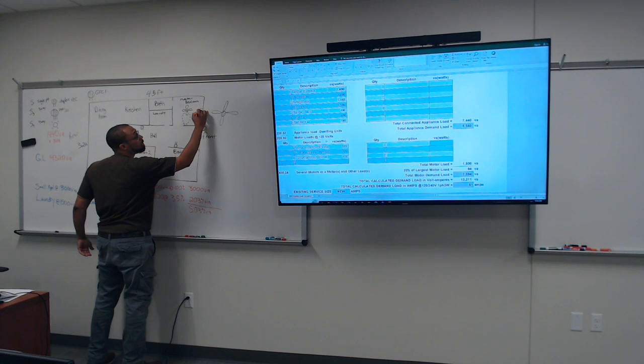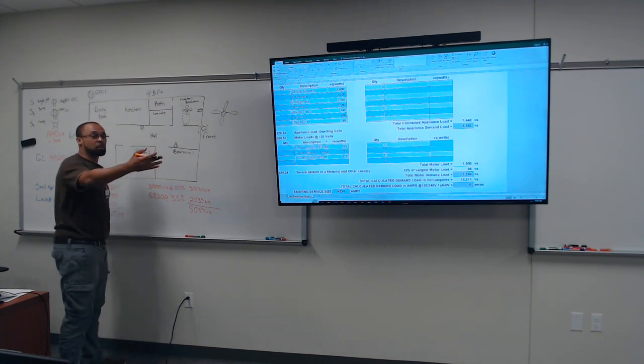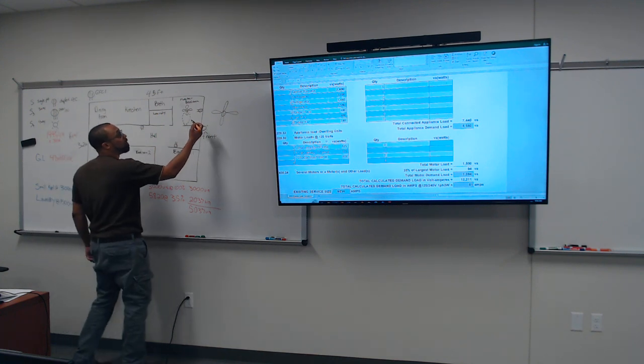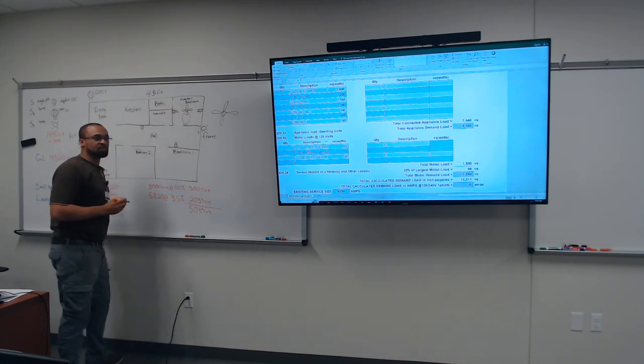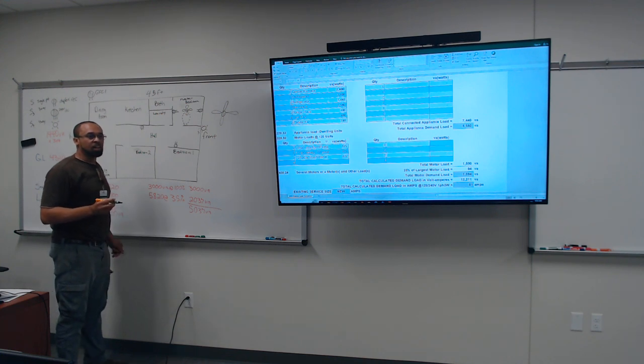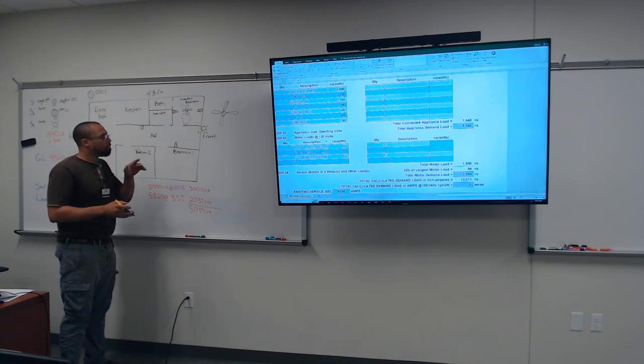All right, so we're gonna put probably two where your bed's gonna go, so you have one for each nightstand. Say it again? I put two wherever your headboard's gonna go, so you have a receptacle for each side. Yeah, and that's where that comes into play. Is that on each wall, that set distance, or do you start at one end and work your way around? Yeah, it's working your way around, because corners do apply to that rule. I gotta go find it, but I just wanna continue on this.